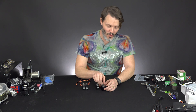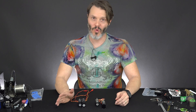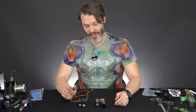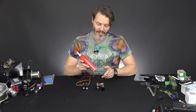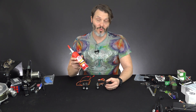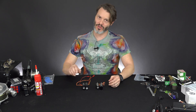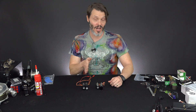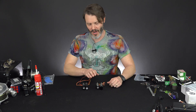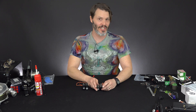If you would like to get into water, the one weak point on pretty much all servos is the feedback potentiometer. There's no good way to waterproof them and still keep them functional. What I would recommend if you're going to go dunking all the time: take the back case off and fill it up with dielectric grease. This will keep the water out of the potentiometer and generally doesn't freak it out. Just be forewarned — if you get grease really deep inside that potentiometer, sometimes it will cause centering problems. It'll either jiggle or it'll want to overshoot and hunt for center, so just be cautious of that.